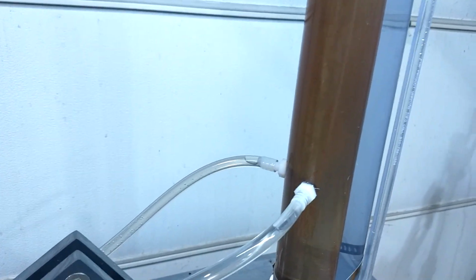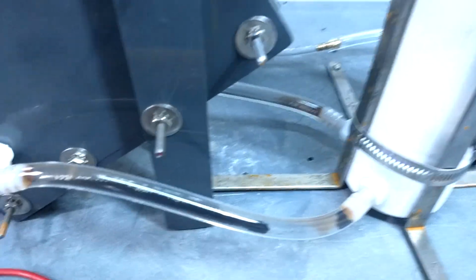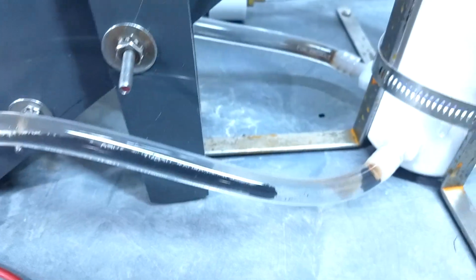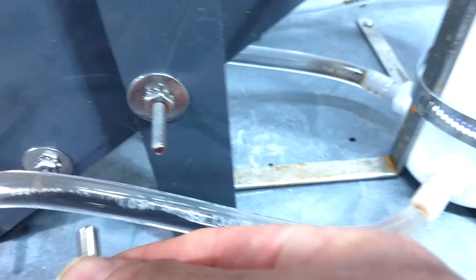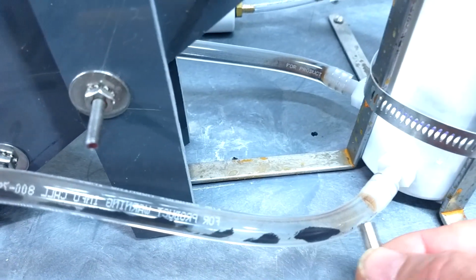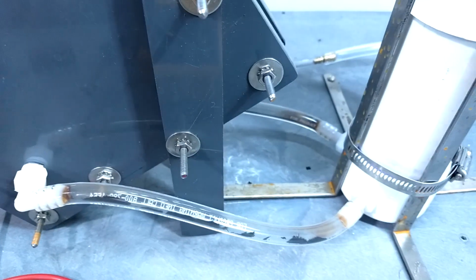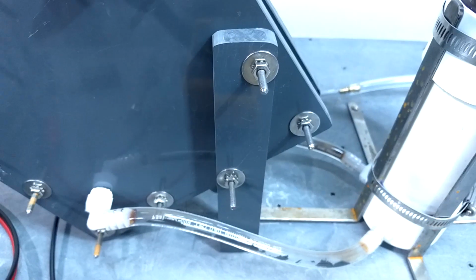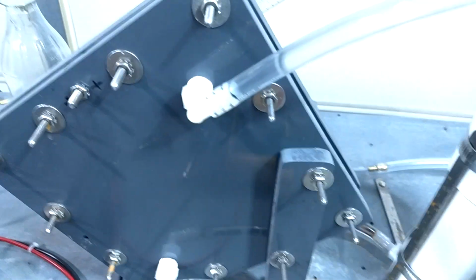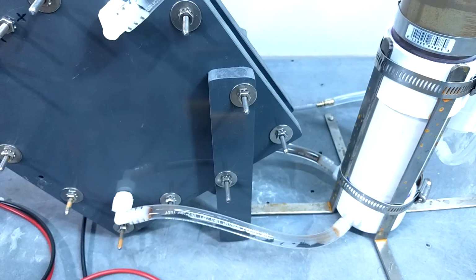Now, in the past, I tested that with a magnet in the bottom tubes, and it was not magnetic, but now I'm seeing black stuff, and here's a magnet, and we can see this is definitely magnetic. So I think we're actually deteriorating the plates inside, and I think the experiment's over. But I'm going to go ahead and tear the unit down and see what we have inside there. And then we'll probably rebuild it with stainless steel plates.